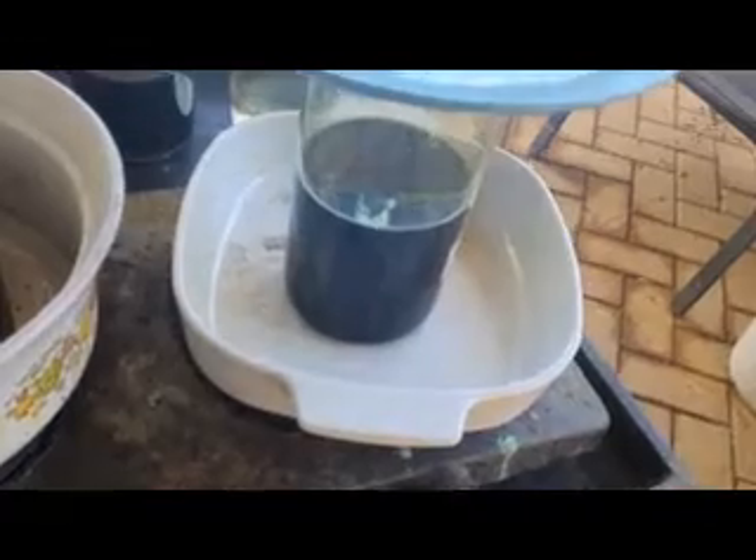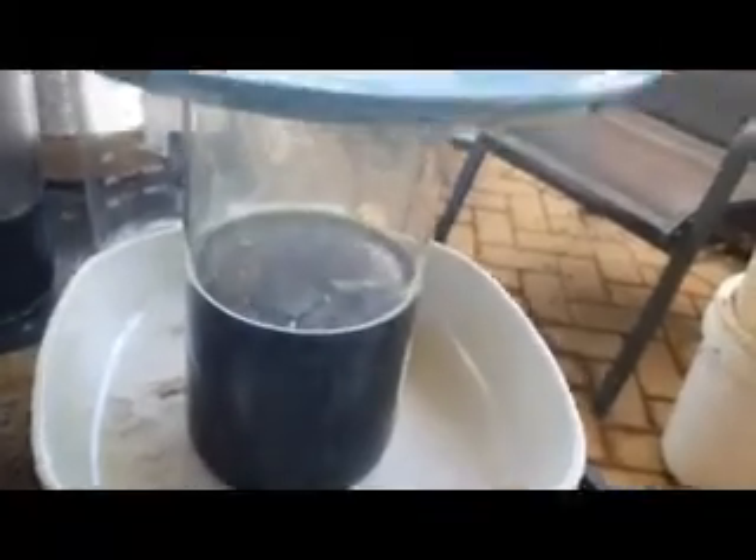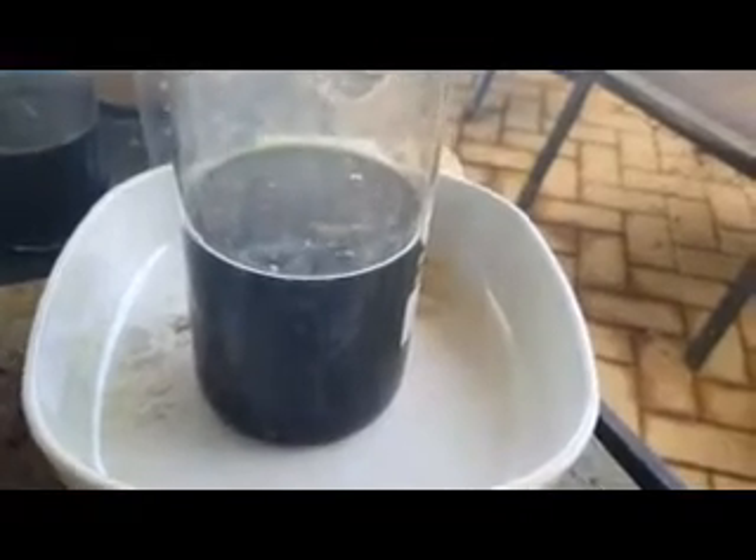See if there are any more fumes. It'll take a while. If I don't see any more fumes then I know that everything is dissolved and I can take the plate off and just boil off that bleach. The best thing about using bleach as opposed to nitric is that with nitric you have to de-nox it, but with bleach you don't — you just let it boil away, it evaporates. It's been five or ten minutes since I put the bleach in and there are no fumes, so I'm fairly certain it's all dissolved.